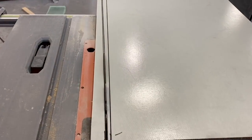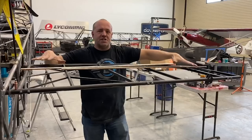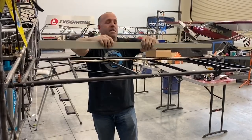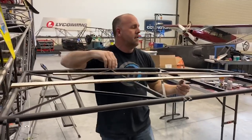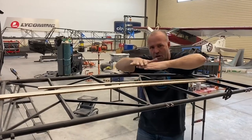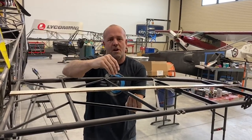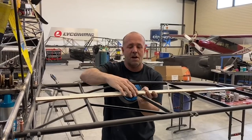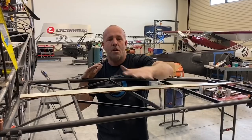It has to be center from front to back here. And even though this gets narrower, it comes center front to back, so the line actually travels on a little bit of an angle that matches the shape of this. So I'm going to make a beam by cutting out notches to go around these bars. I'm going to drop this down through the frame and add another one. We're going to go from 3 inches thick all the way back to the original shape and put an arc to all the carbon fiber. These two pieces will come together, and then I'll fiberglass them. I won't use carbon fiber against the metal, aluminum, and chromoly — I want to eliminate as much galvanic corrosion as possible. But I'll make an I-beam, and the tops of the I-beam I'll do in carbon fiber, and that's what will make the permanent bond to the carbon fiber skin.